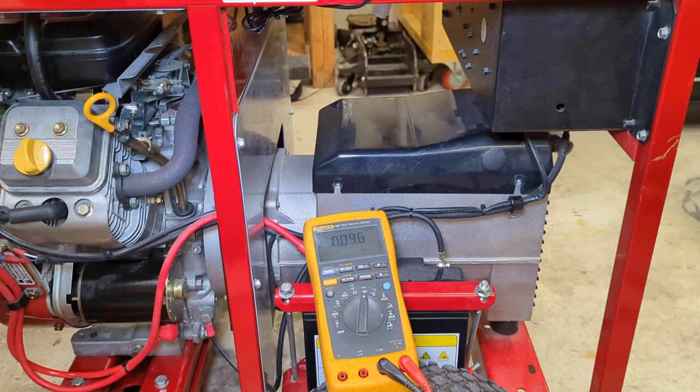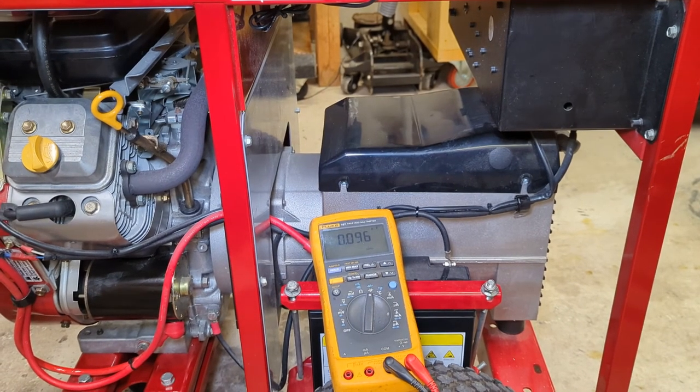And again, I said it before, but pretty sure things didn't get captured. You always want to have a spare one of these, or in this case, two of these, because those capacitors could stop working at any time, and a generator is kind of like a critical power device. So you want to have one ready to go of whatever size your generator needs. Not every generator is going to have the same size. So you got to take yours apart if you do have a capacitor-excited generator and see what you got. Normally, you can just use air conditioning run capacitors. That's what I usually do.